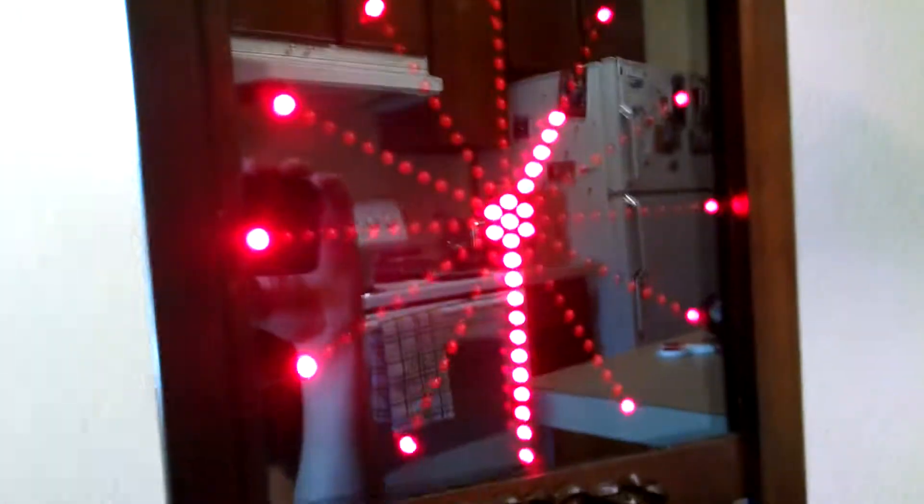There are two rows of 12 LEDs. The bottom row is the minutes counter — 12 five-minute intervals for one hour. The top row is 12 LEDs corresponding to each hour. Every time the counter reaches 300 swings (five minutes), the minutes counter increments by one. When the minutes counter reaches 12 increments, the hours counter increments by one.